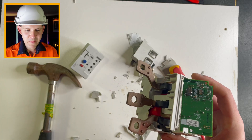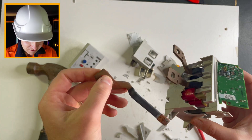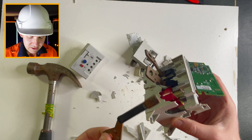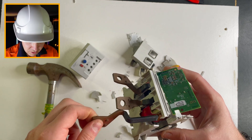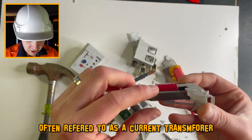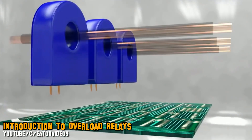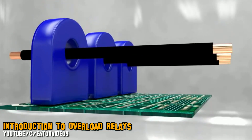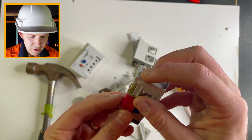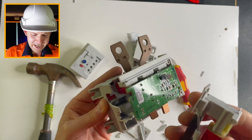I've been able to get it to a point where I can take it apart. As you can see, there's no point where you can break the load — it's actually just a solid copper bar where you detect the load current through it. The way it does that is using something called a toroid: laminated sheets of iron put into a coil. When the magnetic field from the load current passes through it, it produces a current detected by the printed circuit board. Depending on what you set it to, it will trip within the adjusted trip class. If you enjoyed this video, make sure you like and subscribe.